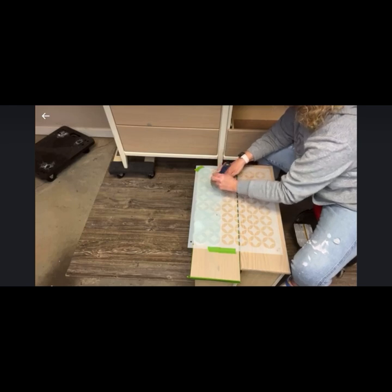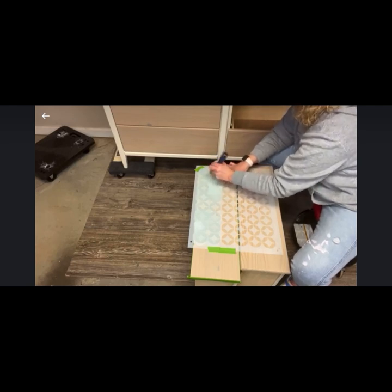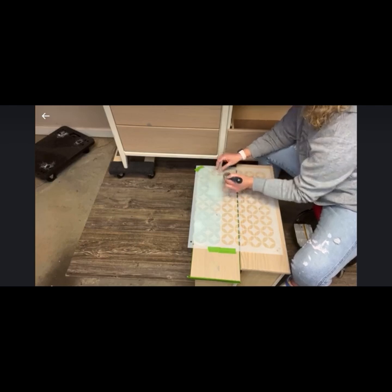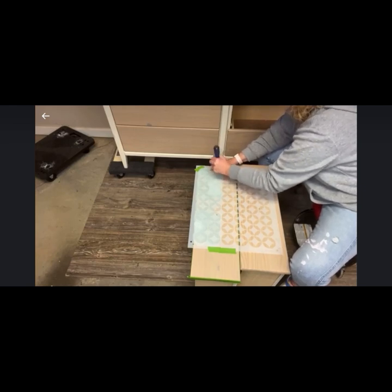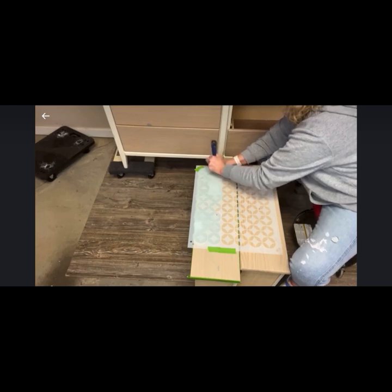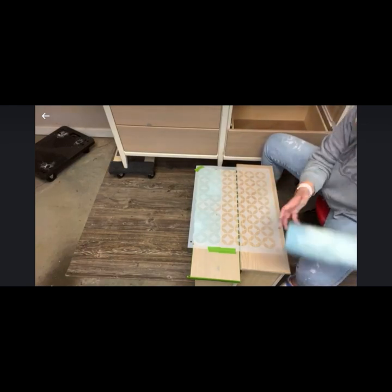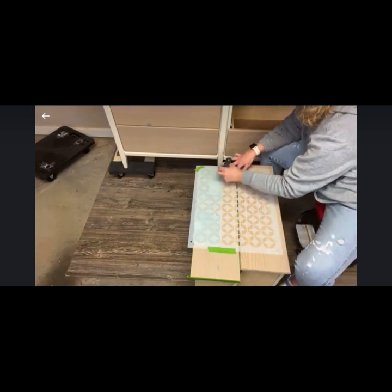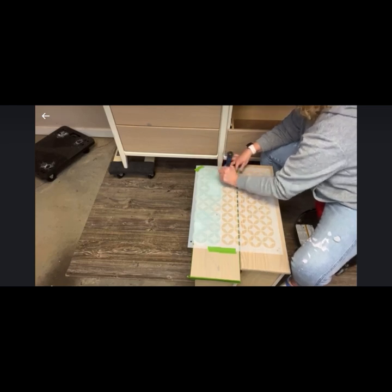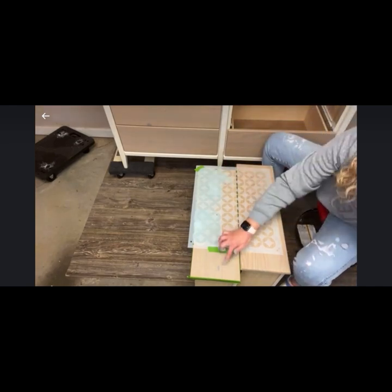I'm also gonna probably go over this, and I forgot to say this earlier, in between this, I did protect my drawers with a satin clear coat. I like to do stuff like that before I stencil, because if you're quick enough, you can wipe off if you don't like whatever it is you're doing. I did go ahead. You guys, I have my heater on out here and it was really cold, but now it's getting really warm. But I always like to protect first, because that's going to protect my color wash here.